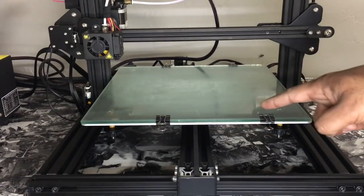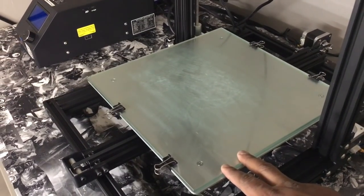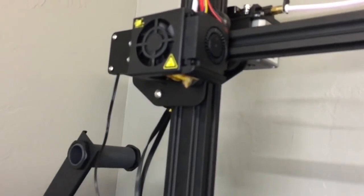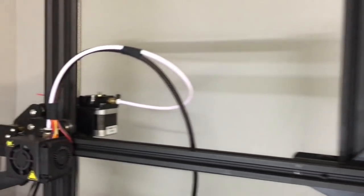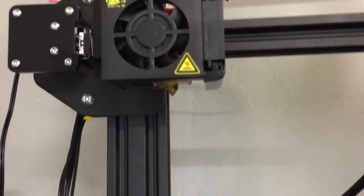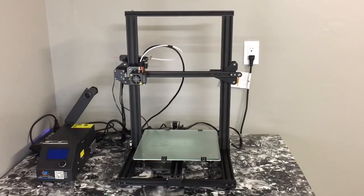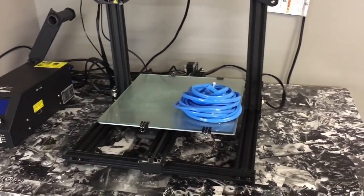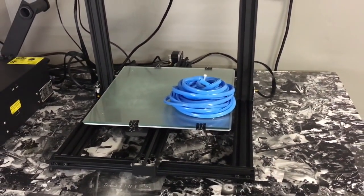Just like the CR-10, this printer has a 300 by 300 by 400 print surface. The CR-10S also comes with a heated bed. It is a Bowden tube type extruder, and the nozzle is still the same MK-8 style. One thing I do like about this model is the air nozzle on the two fans — it's no longer hitting the nozzle itself, it's actually hitting the tip of the nozzle where it should be. The CR-10S has the same all-aluminum frame as the CR-10. It also comes with this blue strip you can insert between the lines, though I decided to leave it off.